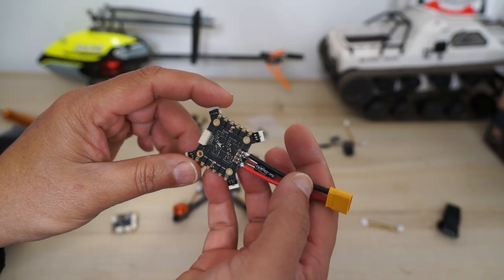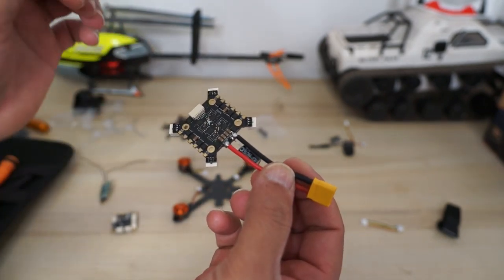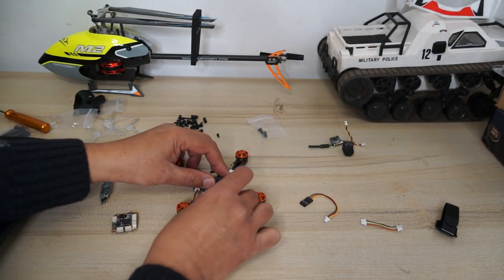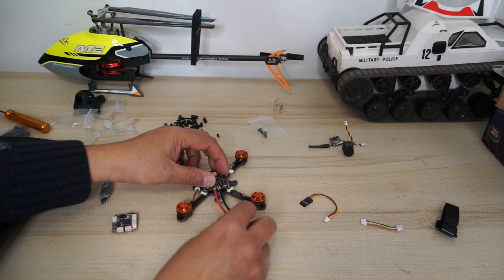Okay, the capacitor installed. This is a critical step. You have to be very careful, plus to plus, minus to minus. Don't make mistakes there. Now the board will sit here, and installing the capacitor down, you can always configure it, like push it up and down.